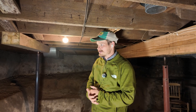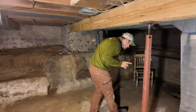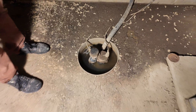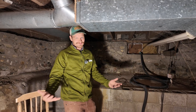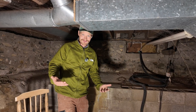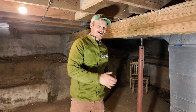There's no sump pump down here and no drainage around the foundation to take water away. To truly remedy this seems next to impossible without lifting the house and putting a modern foundation with modern drainage underneath. Actually, wait — there is a very ghetto sump pump over here. Oh boy, there's a dead mouse in it. There's no underground drainage pipe going into it; it's just for when the basement floods, and you can tell by looking at the ground that it obviously does flood regularly. There were no sump pumps in 1906, so there's no perimeter drainage unless someone added gravity-flow pipe later.